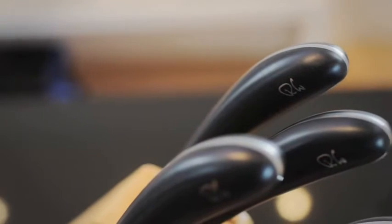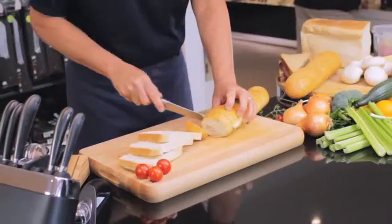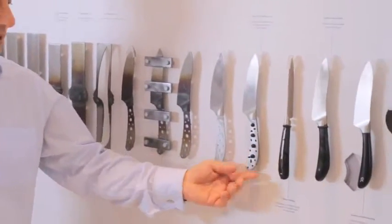We looked at the angle, the shape and cross-section of handles, what's comfortable to hold, whether to go for a straight or a square section handle or a curved. We went for a mix of the two. Also, we had to consider the centre of gravity of a blade and how it balances and holds when you're using it.